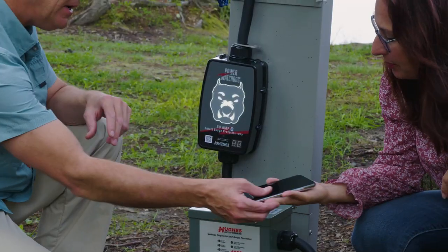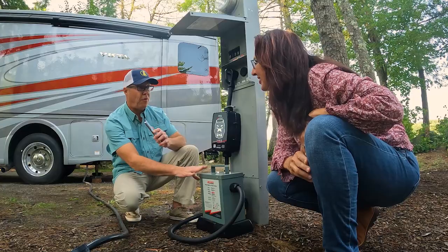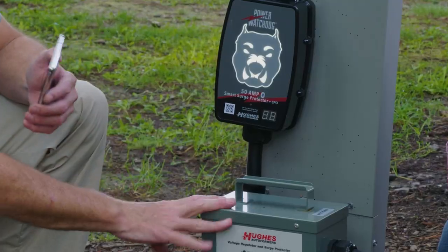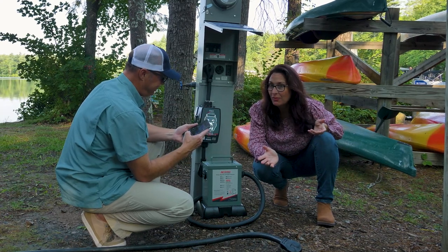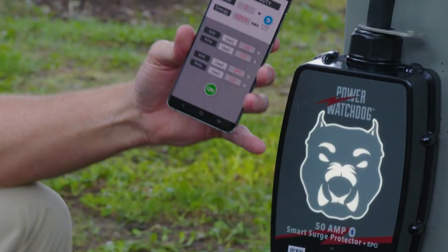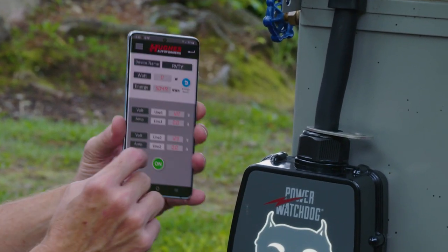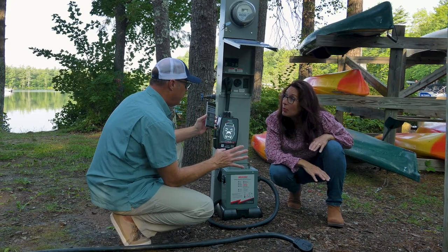That means this is powered on. What's nice is they've got this app. I like to know my power number before I plug in the booster. We use the booster every time just to be sure — there are a lot of RVs lately and we've been full at every campground. So let's hit the Power Watchdog app. We've got two lines showing up: one's at 122, one at 124 — that's good, clean power.